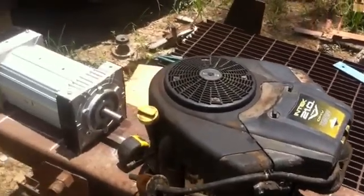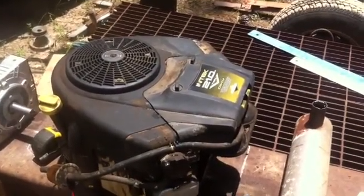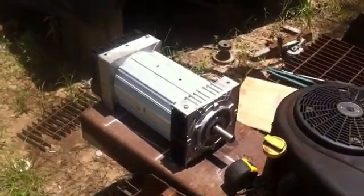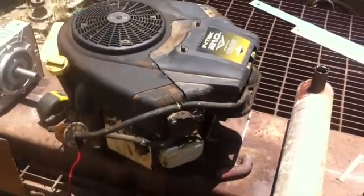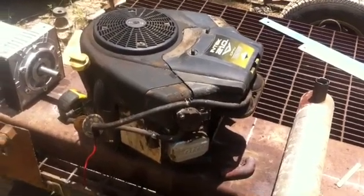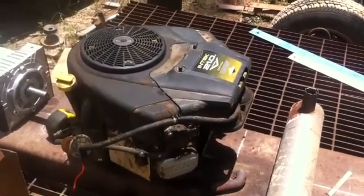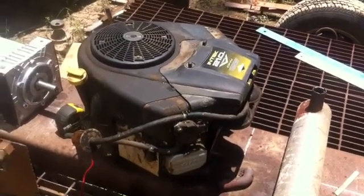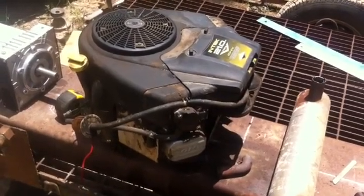That's a 21 horse motor, and 16 horsepower is required for the welder to operate, so the 21 horse will be more than enough. I'm going with a 5-inch double pulley on the generator head itself and a 6-inch on the power plant, in order to bring the RPMs from 3,600 on the engine down to 3,000. Peak torque on the Briggs-type motor there at 21 horse is just under 3,000 RPMs, so I'm bringing the RPMs from 3,600 maximum operating speed down to 3,000.